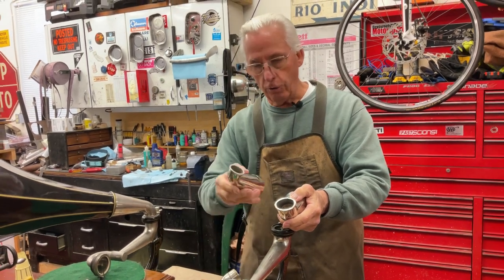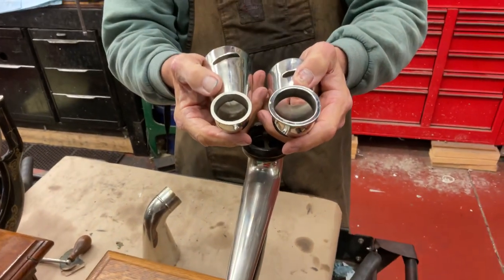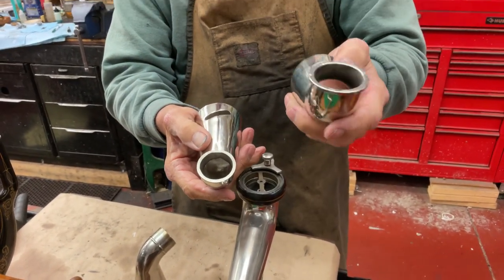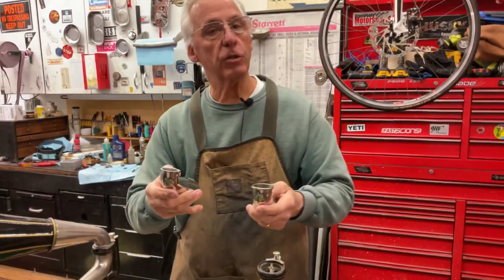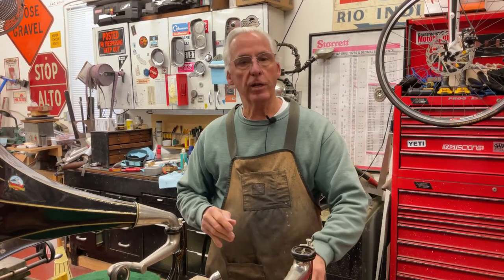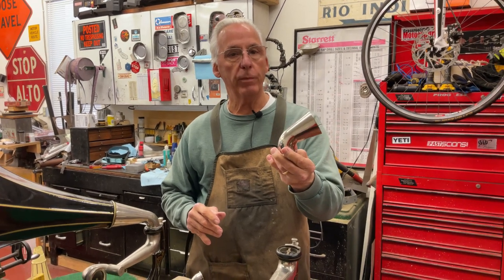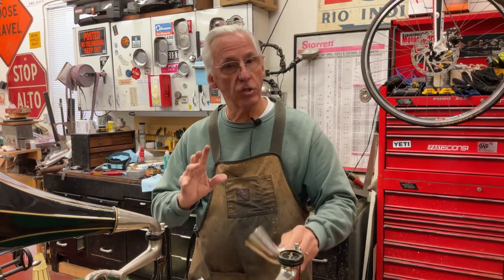On the Victor 2, you can see the size difference here. This is what becomes critical on the phonographs — you can't put this one on a Victor 2. Only a Victor 2 yoke fits on a Victor 2. For Victor 3 through 6, you can use the same yoke on all of them. They'll all fit because all the ends of Victor horns are the same.